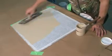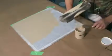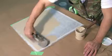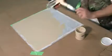A pull trowel as shown here is a good tool to apply a quick loose-handed layer. Try not to work straight up and down or straight left to right. To increase the speed of the first coat, simply roll the first layer onto the wall and smooth with the trowel. Allow this layer to fully dry, then switch to a smaller, stiff broad knife.